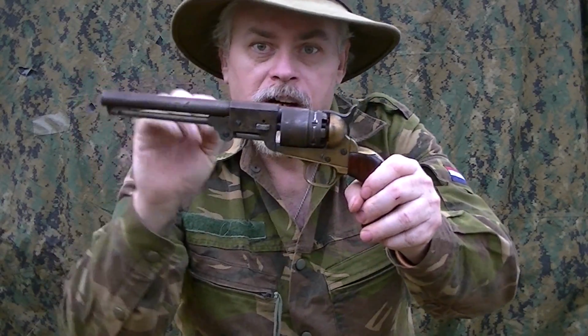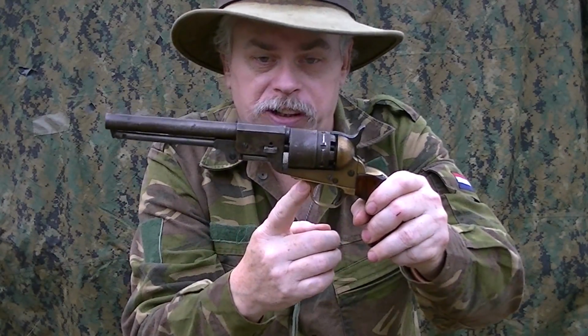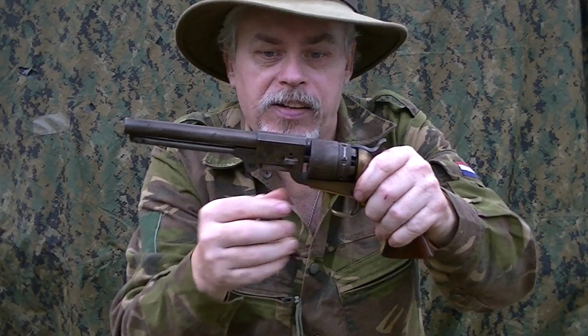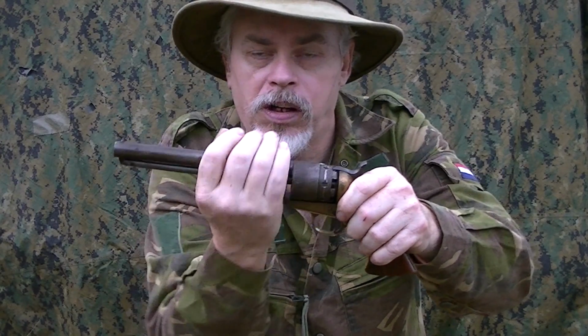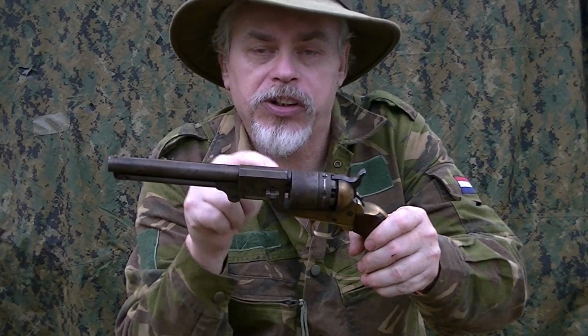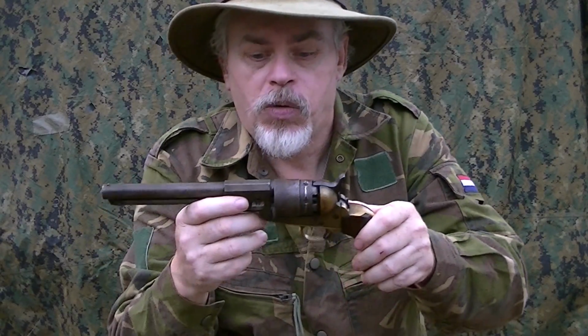Okay? Now, back to the brass. The brass frames, being softer, when you fire one of these open top Colt designs, the pressure hits and the cylinder is forced backwards where it bottoms out. At the same time, the pressure hitting the barrel is pulling forwards. So you have forward, back at the same time. This stretching action causes where the cylinder base pin screws in back here to pull forward a few thousandths of an inch. What happens is that when you sit here and you look at it, it does not look that bad. Once you start firing, that pin starts pulling forward a few thousandths. Now, let me give you a very clear example of this one has shot loose. What they mean by that.